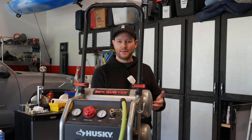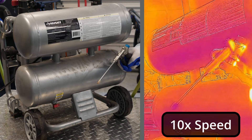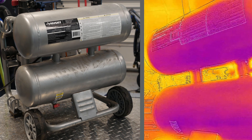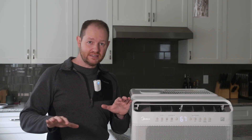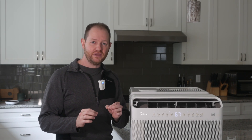This moves us into what I'll call step two, or what happens in the condenser coils. That hot gas needs to radiate its heat out into the environment — a step that normally should take place outside of your house. So we're going to let this entire unit cool down to ambient temperature again, but we're not going to release the gas just yet. After about 30 minutes, the whole unit's cooled down. Let's look at the thermal camera again and see what happens as we release or expand that gas — analogous to what happens inside your evaporator coils, which should be on the inside of your house. Did you notice those tanks cooling down as the compressed gas was released? That's the refrigeration cycle.